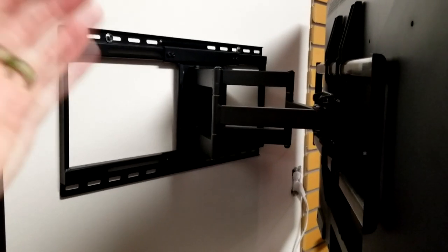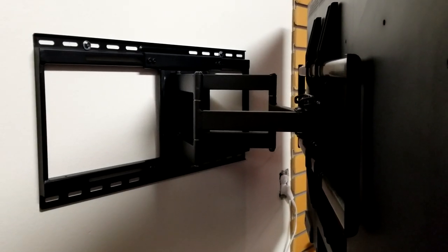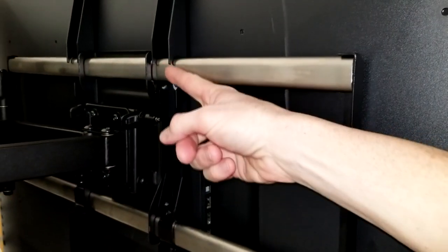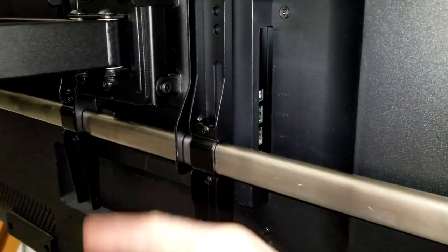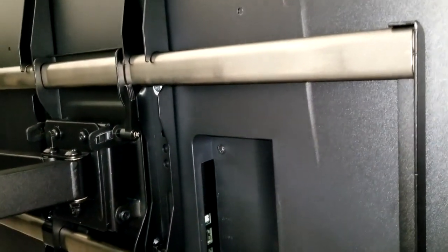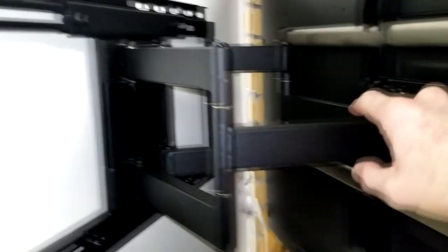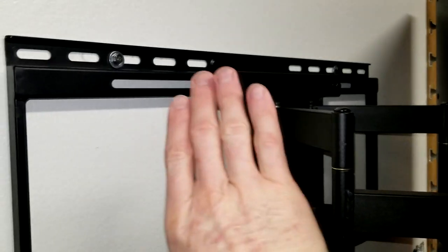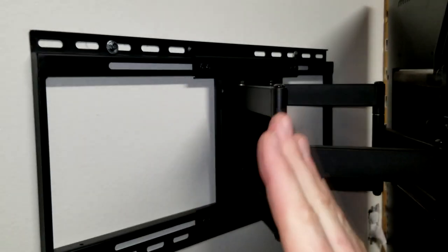Overall, I'm super pumped on it. It was so easy — I already had a mount up here and was able to install this thing very, very quickly. Let's look at the back a little bit closer. Once you hang the television, you have your clips right up here, then you just install the little bracket here that has two screws on each side, and you are fully dialed in, not worrying about that coming off the television at all. Absolutely fantastic. If you do need to slide it like I did, just loosen up all four of those and the whole thing will push back and forth. I loosened those — I did not remove them completely — and I was able to slide the television. Just be careful and have a spotter because we do not want to crack any television.